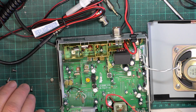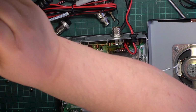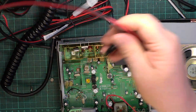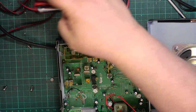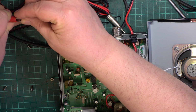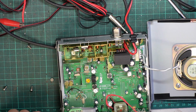So we've got a fiberglass board with a few adjustments. I'll connect that up to the right power supply. Because we're doing a business radio, I was on the 18 amp power supply, so we'll go over to the 2.5 amp power supply. I don't think we're going to need to press any emergency stop buttons on this set, but the power supplies are connected via a contactor. For those of you who don't know, a contactor is a relay used in industrial applications, usually for motor starting, and you will normally have the stop and start buttons, and we have those.